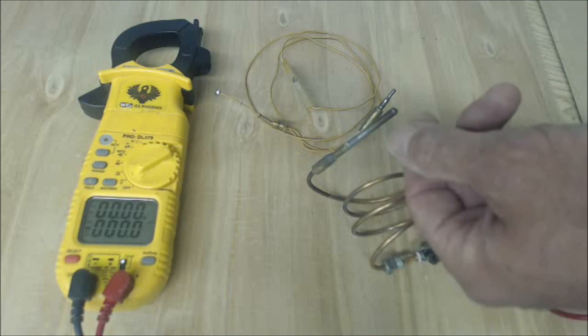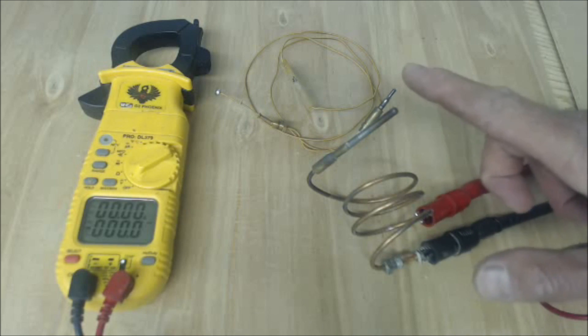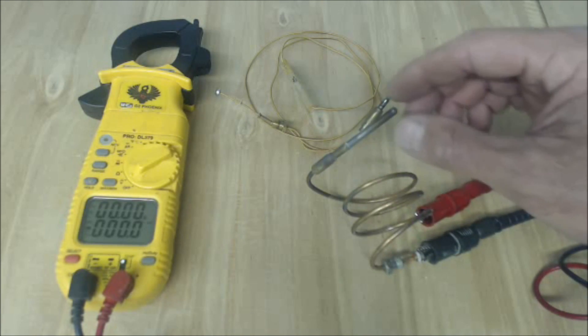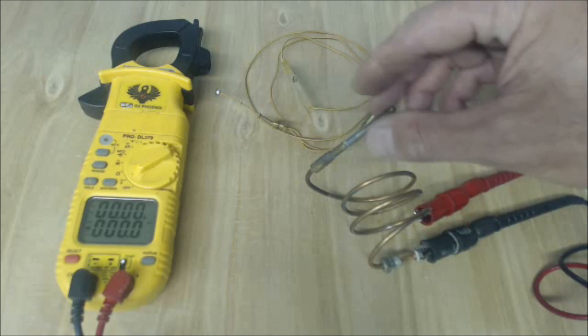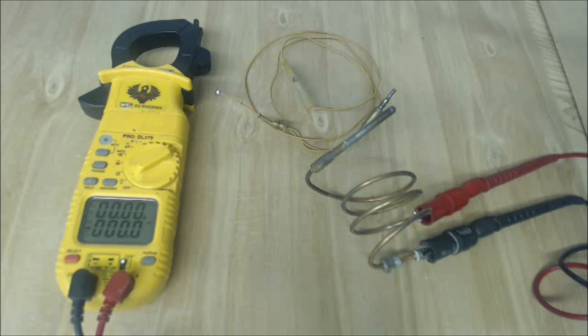You can also check the actual flame and check the head of the pilot tube, making sure that the flame is actually engulfing the thermocouple rod. Sometimes you can actually adjust the pilot pressure for the flame. You've got to make sure that it is engulfing that clip.